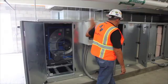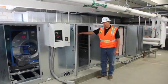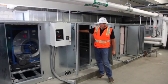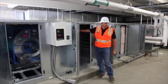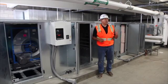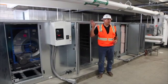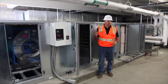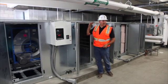Again, the inverter for the return fan. This is the mixed air plenum — it's the discharge of the return fan. On the back side is your exhaust. Under Title 24, you have to bring a minimum amount of outside air at all times. When you're at that minimum position and the outside air temperature enthalpy or dry bulb is cooler than return air, you can go into a full economizer state. That would be your exhaust — the warmer air gets pushed out and sent outside.